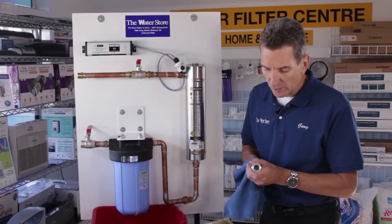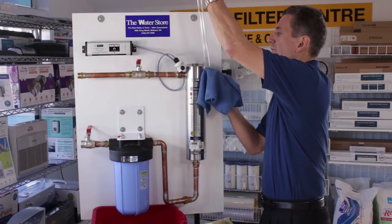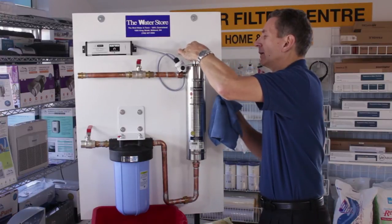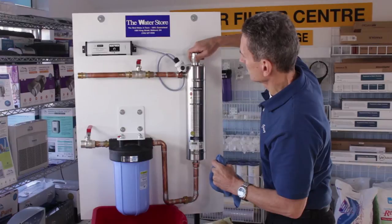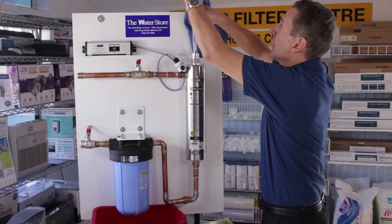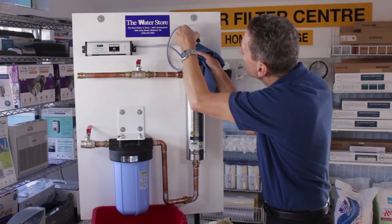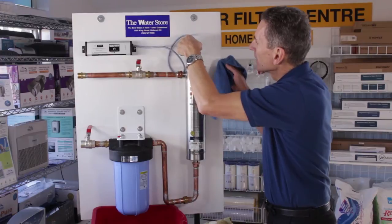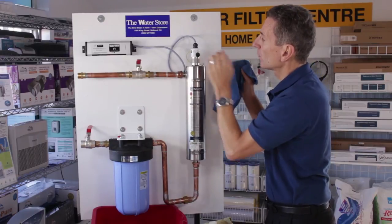Put a little bit of water on the outside of the quartz sleeve as a lubricant, and then gently slide it in — the quartz sleeve is quite fragile. Slide it in until it butts right up to the top edge of the gland nut. Then, using your cloth so you don't get any fingerprints on it, make sure the spring stays inside and slide that back in. Hand tighten that. Then insert the new bulb, grabbing it with your clean cloth and handling it only at the ceramic ends. Slide it down, line up the pins on the top, make the electrical connection, slide the whole thing down, and tighten up this nut on the outside — it's only plastic, so just tighten it slightly, just enough to hold the cap in place.